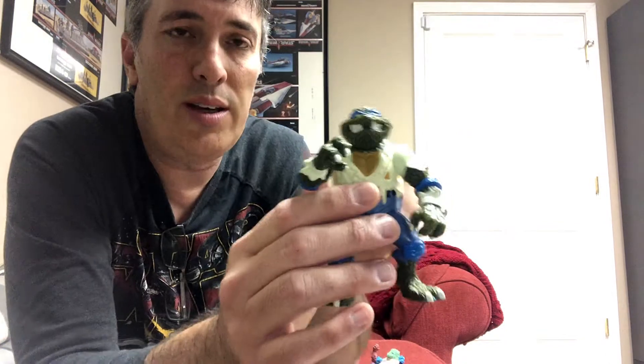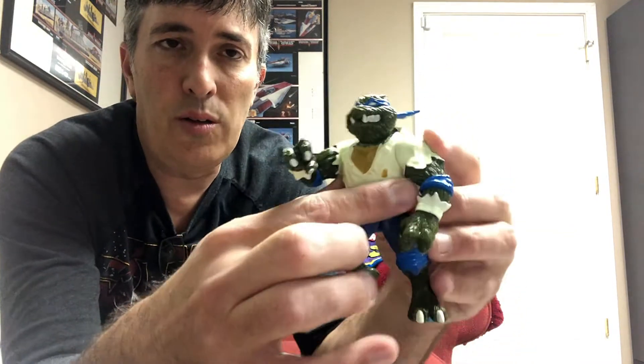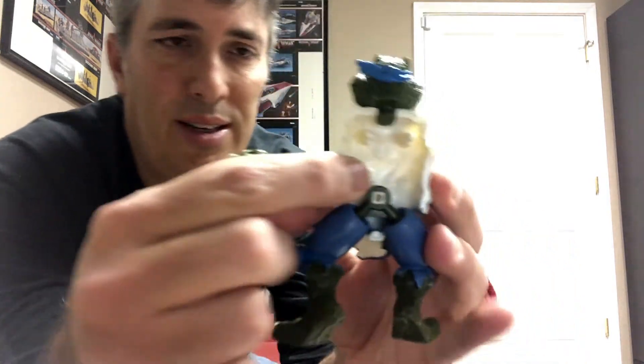This one is probably more like a pilot figure. A pilot is when they've debugged all the tools and everything is ready to go, but they need to test the entire assembly line — not only are the tools running right, but the part falls into a bin, rolls down a conveyor belt, employees on the line pick it up, assemble it, do the welding, paint ops, and so on. That's called a pilot run. Those figures usually aren't sold either, but they're very close to production. This figure is probably out of a pilot run — it looks much like a regular figure, but it's not welded together. I can pull the torso apart and you can see the inside of the figure.